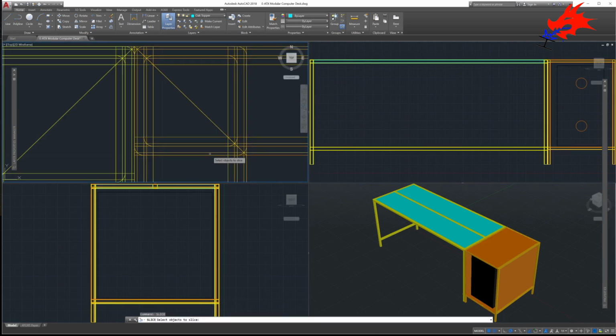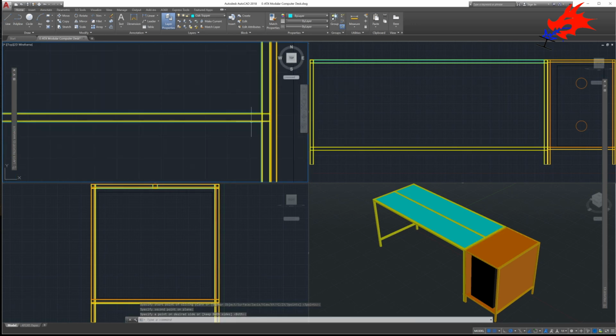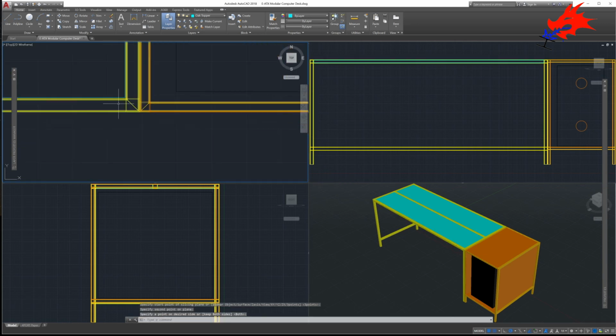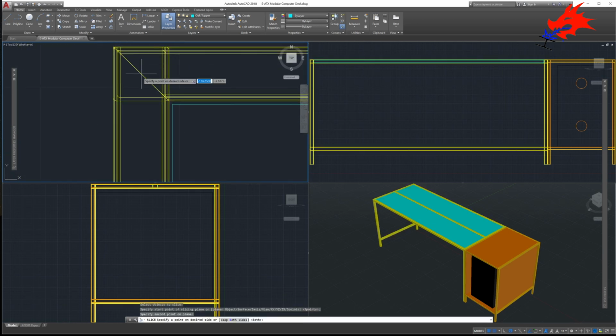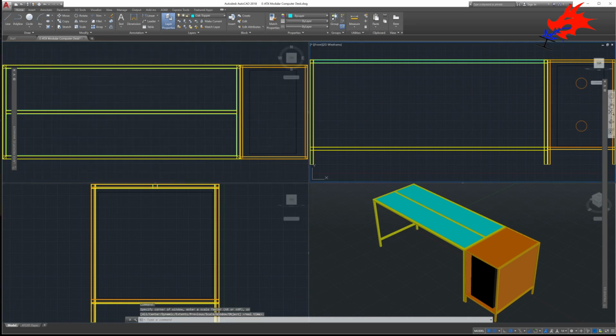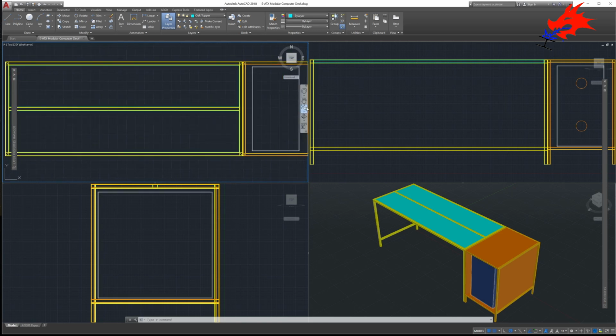All right, next, clean up all the corners just so we have exact edges, 45-degree cuts. Right on here, every corner, you're gonna cut flat on the top, 90 degrees straight only, because on the bottoms you're gonna have to do pieces in between because the legs go down. So you'll do slice, then you go from corner to corner, and that gives you the cleanest, straightest line. Sometimes when you have to do mods where you don't have exact 45-degree angles, when you do corner to corner, it'll give you the exact cuts you need. It's 30, 29, 28 and 3/4, 26 and 1/16 degree, you know, that kind of thing.